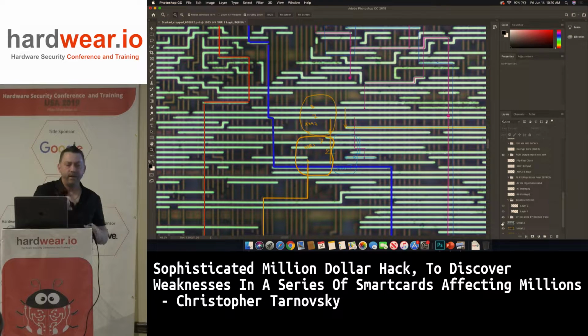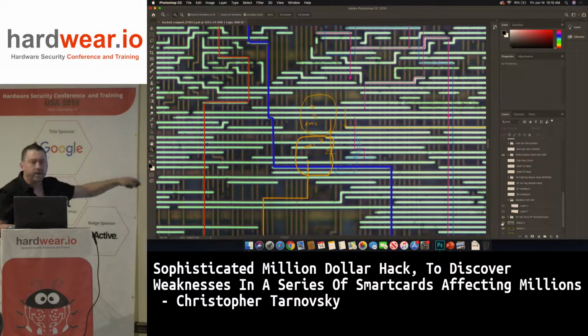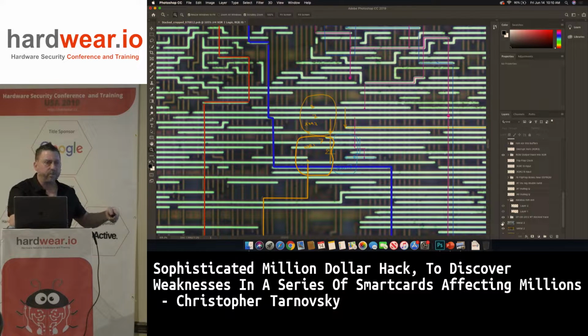and then drill a hole like you saw yesterday on Samsung, and then in that hole I can see deeper. If I keep milling, that gas that I run, that xenon difluoride gas, is gonna etch through the shield and leave those shield wires intact, and then it's gonna mill down to these wires here. So I move over, for example, 500 microns, down 600 microns. I make a big hole, and I look through the hole with the machine at this layer with the shield still intact. Do you follow me? Kind of? Okay. I showed it to you yesterday on those pictures.